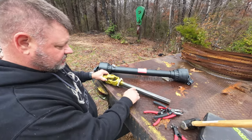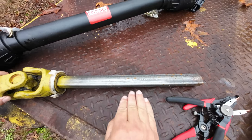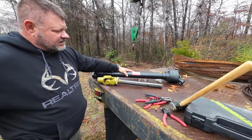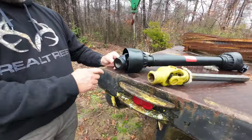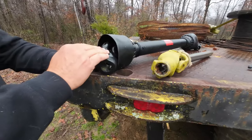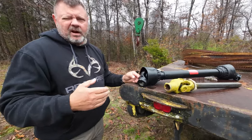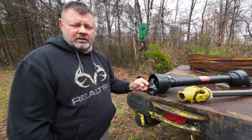This drive shaft - you can see the twist in it right here. The straight line is no longer straight, it's got a nice curve to it. That's just because this is a very thin shaft that was not impressive at all. So I ordered a heavy duty shaft, actually for a bush hog. It's really thick and heavy duty, but it came with this particular type of end - it has the splines and this one does not. So I'm going to swap out the ends, and in turn that's going to show you guys how to swap out a universal joint if you've never done it. I'm going to do this as if you were doing it in the field without all the perfect tools - we used to have to do this in the army, and that's how I learned.